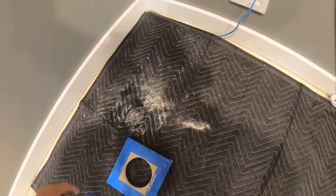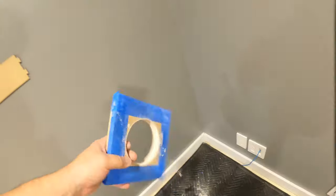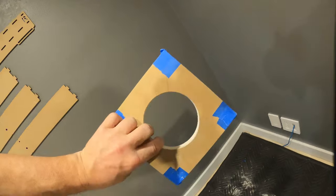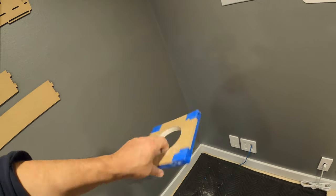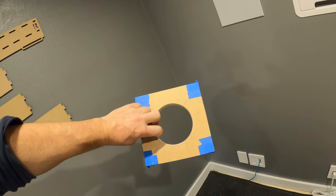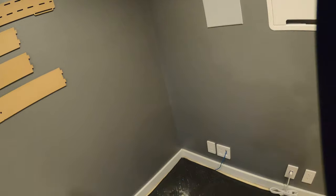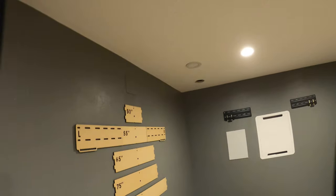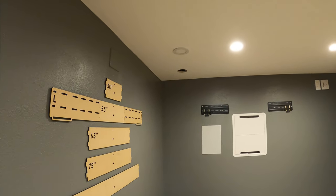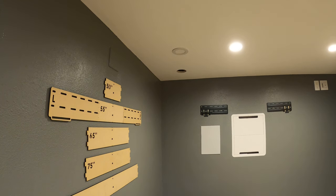We still have our template for another job down the road, and that's why I use blue tape — so it doesn't get stuck on the template. This template has some drywall on it; I've used it on about four jobs now. It's just a six-inch by six-inch piece with a four-inch hole in the middle — good to go. That's going to conclude this video. A little training on installing four-inch cans for electrical, lighting, speakers, cameras, or any four-inch device. If this video helped you out, subscribe and maybe give it a couple thumbs up. Thanks a lot.